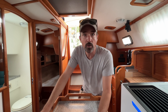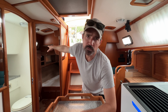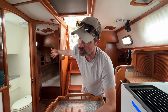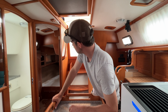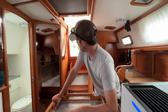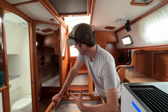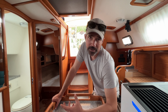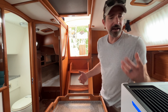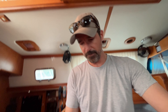This aft quarter berth over here is what we're working on. One of the port lights was left open for like a month, and water was dripping in — a whole bunch of damage. Looks like some sanding was done. We've got some stripping to do of some varnishes where the sanding couldn't be done, and really we're here to evaluate it. The fans are running, keeping moisture down. We've got a small dehumidifier.